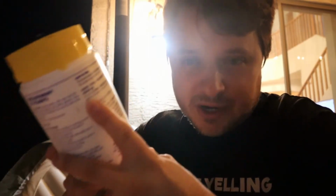So this is 1 1/4 ounces to raise the total alkalinity by 10 ppm. We don't need a full 1 1/4 ounces because we don't have 500 gallons of water. We have only 177, so we need to adjust that down a little bit. Just like with the Spa Shock, I'm gonna add about a tablespoon of this Alkalinity Up. Then we're gonna let that dissolve, and then we'll test the water and see what levels we're at.